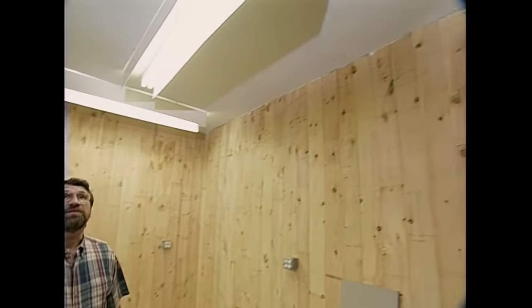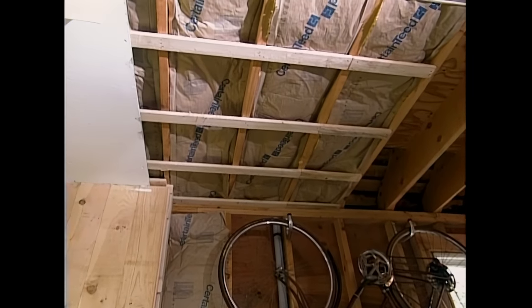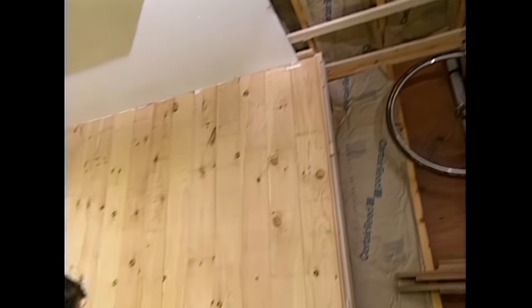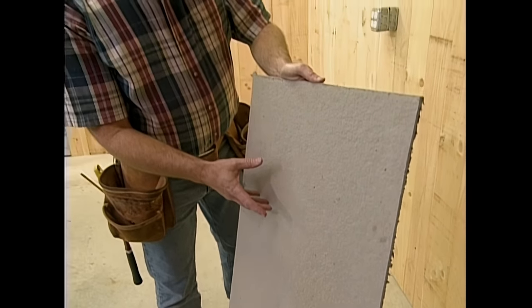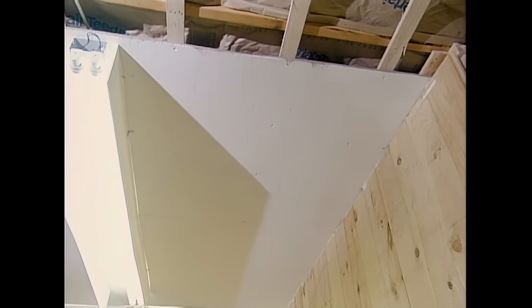I left some of the ceiling open so I could show you what we did before we closed it in. We added some six-inch insulation, then some one-by-three strapping onto the bottom of the joists. After that was done, we put this half-inch homosote. This stuff has been around forever — it's made out of recycled newspaper. It's about the same price as drywall, and it's very durable. I attach it to the strapping with roofing nails, just butting the joints together. After that, just roll on a nice bright paint. Most workshops and garages are very dark and dingy, and we want to brighten that up.